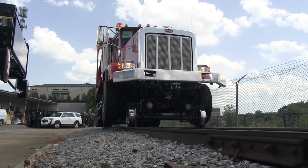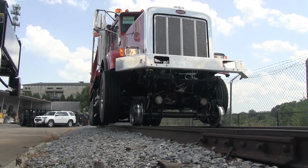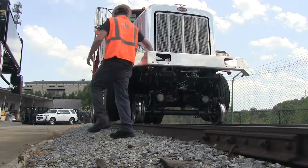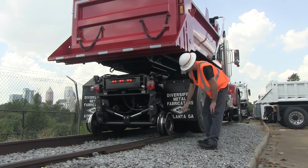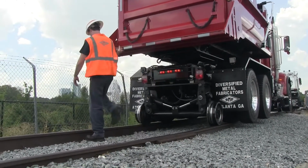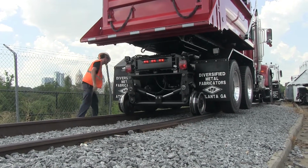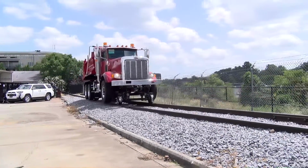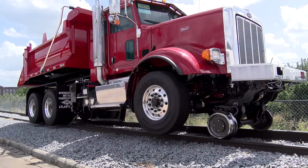After the alignment and weight adjustments are completed and necessary components are tacked in place, the vehicle needs to be rail tested. Drive one direction only before checking rail wheel wear. Then, if possible, run the vehicle forward and backward as well as through curves and switches. Note any abnormal rail wheel wear or excessive flanging. Test the brakes to ensure safe stopping distances can be achieved. If any issues are found, adjust the alignment or weights as needed.